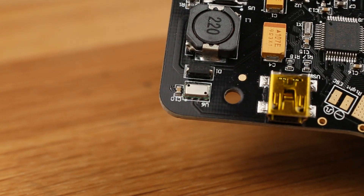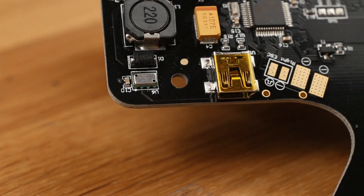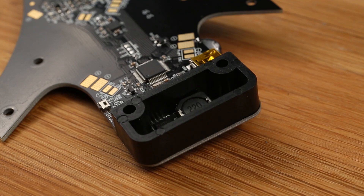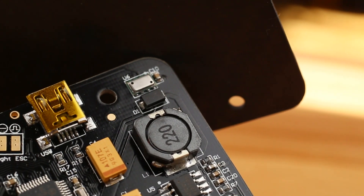There's more — it also has a built-in pressure sensor, and a high quality one at that. Both the BEC and the pressure sensor are mounted inside the front spacer. This keeps airflow away from the pressure sensor and also protects the BEC.